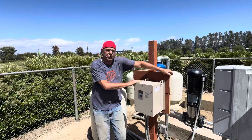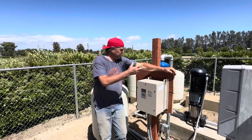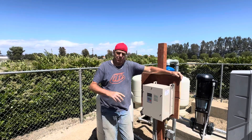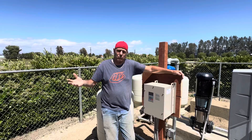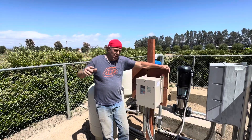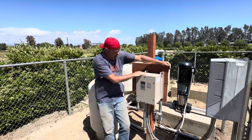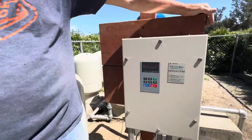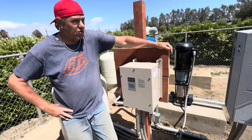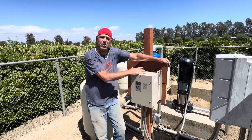What we're running it with is a frequency drive. This frequency drive is a soft start system — meaning the old school system used lots of pressure tanks and it would be dead start, dead stop to wide open. That's how the pump and motor went through life: dead start to wide open. Where this system starts slow and works up to the power, it doesn't snap to wide open, it eases up to it. We got one of the best frequency drives I could put here, which not only runs the well but also protects it — if the water well stops working and the tanks run dry, this will shut the well off and protect the pump.